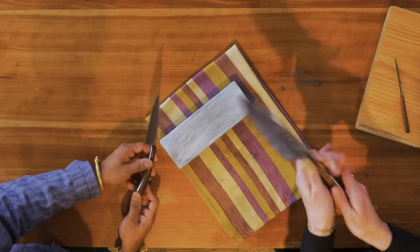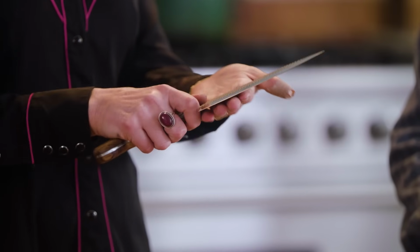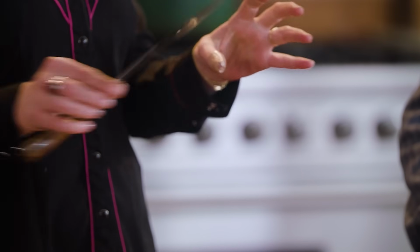So you melt beeswax, add a little mineral oil to create a consistency like a paste. And what I love to do is just slather the handle with that mixture, and also the blade. The blade loves that as well. And then just let it dry for a while, and then just wipe it down before you want to store it. Wipe the excess off.